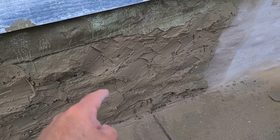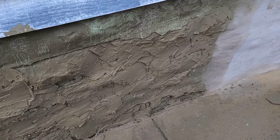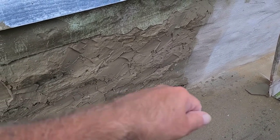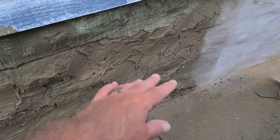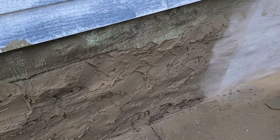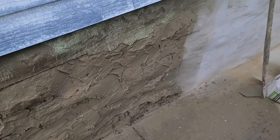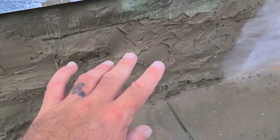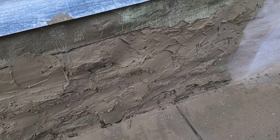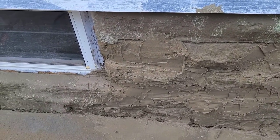When I'm working on an area where it's dirt, I have this board that's like a one-by-twelve, about four feet long. I'll put that board right up against the bottom of the foundation, and as I'm doing mortar work, when the mortar falls on the board I can scoop it off and slap it back in. If I didn't have that board, the mortar would fall into the dirt and get contaminated - then you can't really use it. I do that because I'm cheap - this mortar costs like eight bucks a bag, you don't want to waste it.